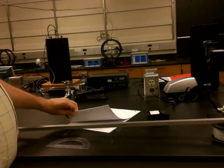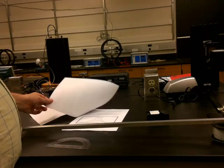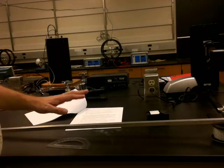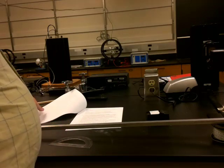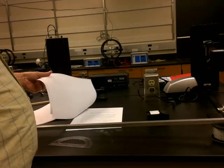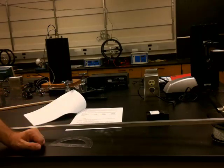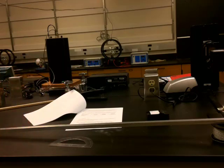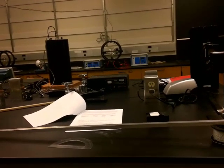The instructions actually tell you some very specific angles that you'll be wanting to use. I'm not going to walk through all the theory work, but you're supposed to use a 2-degree angle and a 4-degree angle. For what it's worth, for a 2-degree angle, I state in your instructions that you need about 1.7 to 1.8 centimeters of rise for every 50 centimeters of length.